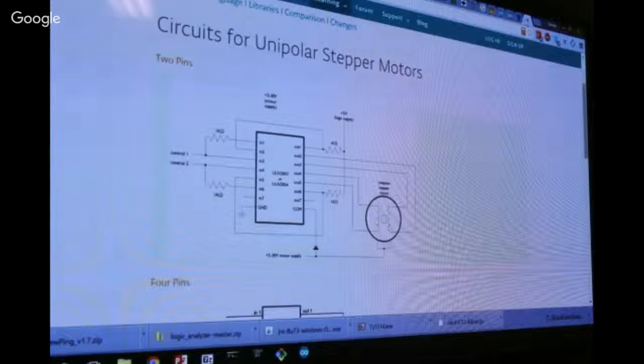And if you look at that, you can understand pretty quickly why I bought it in China for $10 instead of $70. Their design is just as terrible as the Chinese one. But there should be a sea of holes, because there's no way to get heat out of these except plated copper holes from the top and bottom of the board. There should be dozens of them, like 500 for each part.